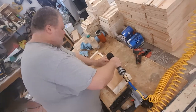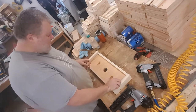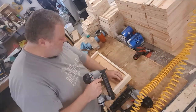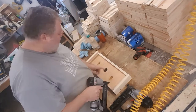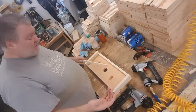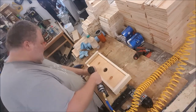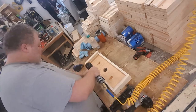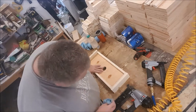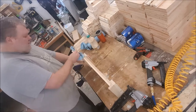Now the little tiny pieces go right in here. Sometimes your staples won't go in very well near the screws, so don't hit the screws. I put four staples in — if I put three I'd probably be trying to staple the same place as a screw and I'd likely hit it. Oddly enough, if you were trying to hit that screw you'd never hit it, but you know. Nail in the ends. That's pretty much it. I'll just wipe off any glue that's around in here. The flush side should have no glue on it because that's where your fence runs on the table saw.